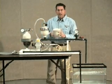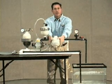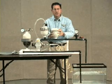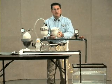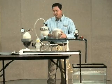On installation, the dampener can be installed horizontally or upside down, as pressure is equal in all directions. Vertical is the preference, especially with a slurry or solid laden product.